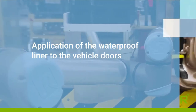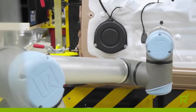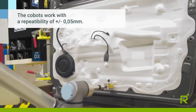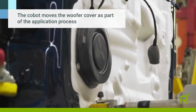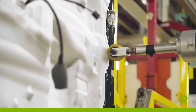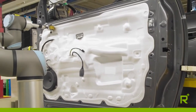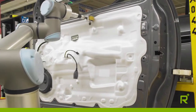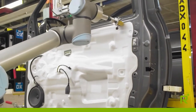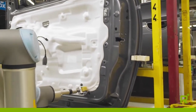The primary need for this choice was the fact that there were obstacles in terms of space due to the architecture of the structure — that is, the center-to-center distance between the bulges, which are the reliefs on the frame where the panel pushpins can be connected. At the same time, we had to seal and then align the sealed part. We turned to the cobot for this because it allowed us to perform a whole series of maneuvers with millimetric precision, guaranteeing the final result.